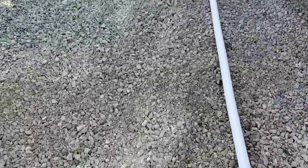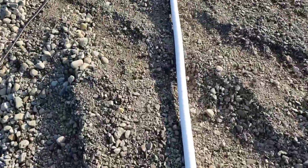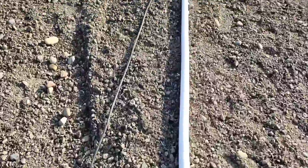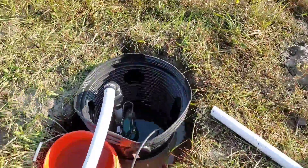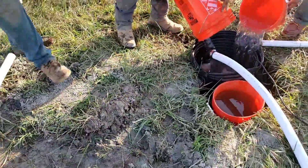We don't build with a check valve for that very reason — it's a liability. You get rid of that when building outdoors. If you want to use a check valve indoors, go ahead. I have one in my house on my basement system. You're only lifting the water up out of the basement — it's not a big deal.